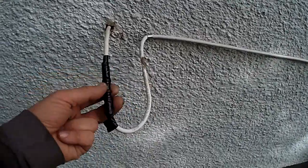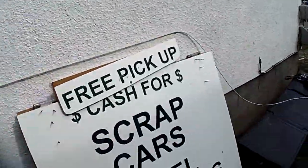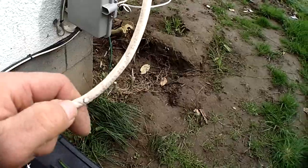There's an outside break — it was spliced, probably by a cable technician. The cable is wobbly along here, and that's not the end of the world, but when I examined the cable itself I found areas where it looked like a dog chewed through it. What'll eventually happen is water will get in and it'll short out, so it's got to be replaced.